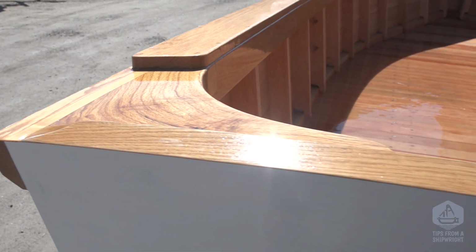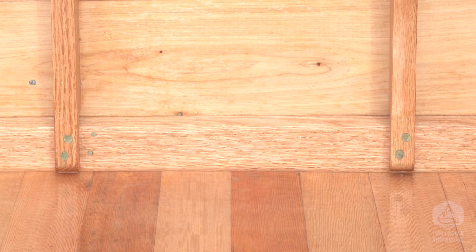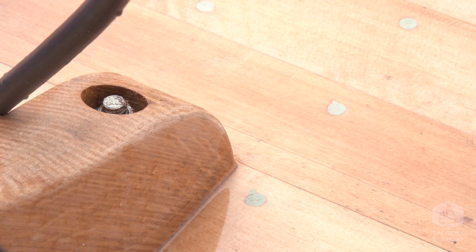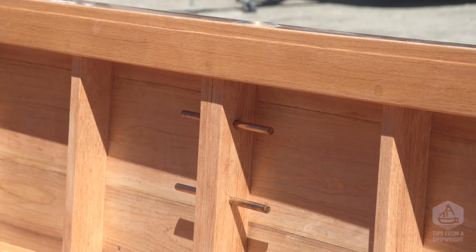Say this boat or any boat that's planked like this, you wouldn't want the boat to be dirty inside once the boat dries out, because all that dirt falls down in the seams. And the other thing you don't do is put it on a sandy beach when it's opened up and let it make up with sand in the seams, because sand will just ruin the seams of a boat like this. You want to have it nice and clean, and you'd be surprised. You can open these boats up maybe 1/8 of an inch. You can almost read the newspaper between the seams in the hot sun for years, and they'll make up again. You just got to give them a little bit of time, and they make up nice and tight. This one's going to be tight in no time, and she'll be ready for the water.